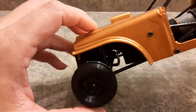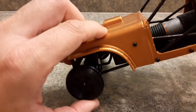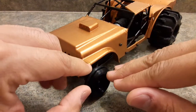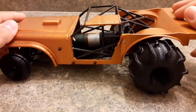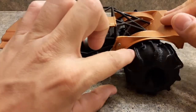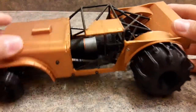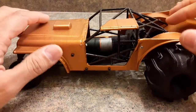You can see how the shaft compresses in there — it's got a much shorter travel, but that's what you need for the front. If you saw the other video, you don't want a lot of articulation on this type of vehicle. You're running in sand or mud which should be fairly flat since it's a race track, so you don't want a lot of suspension travel. The rear does have a little more travel. Going sideways will put resistance on the leaning tire to slow you down without losing much control.